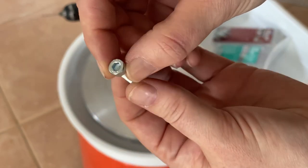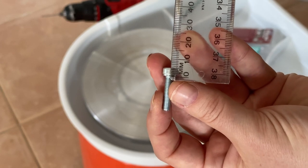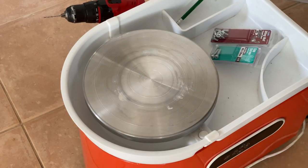This is what they look like at the top, and this is the part you want to check — that it is five millimeters or less, or whatever the thickness of the material you're using is, so the masonite sits nice and flush over the top without a big screw head poking out.